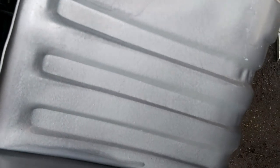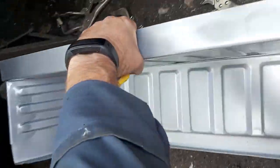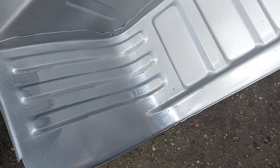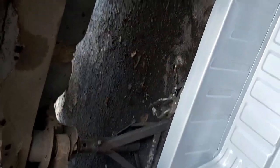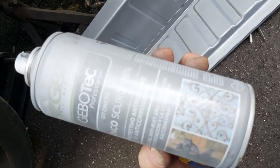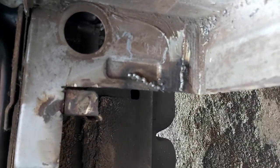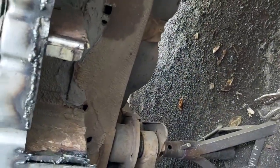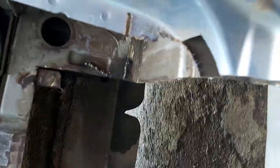What I'm going to do is put seam sealer in this, chop it down fractionally, and fold it over so it fits neatly into this corner. That's the footwell, and the remains of the old footwell which is sound — I welded a big plate on it just to make sure it was extra solid. Get yourself some brushable seam sealer — very helpful. The other essential item is 98% zinc spray, because every time you put a weld on it rusts instantly. In the middle of an English summer it's raining a lot, so every time I weld I'll cover it with zinc primer which is weld-through and instantly protects the weld.